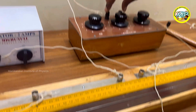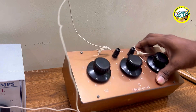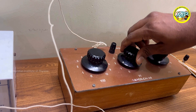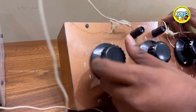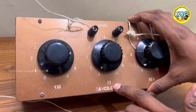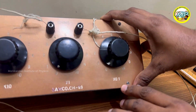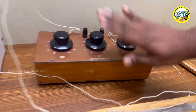This gap is connected with the resistance box, which is a variable resistor. We can vary the value of resistance using this. Generally plug keys are used, but here I am using a different resistor. If I rotate this, values go 10, 20, 30, and so on. It varies in multiples of 1 ohm: 1, 2, 3, 4. We also have 0.1 ohm, 0.2, 0.3, and so on. This is the variable resistor.